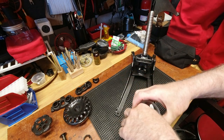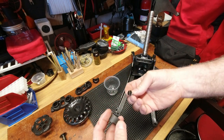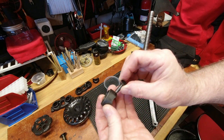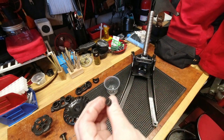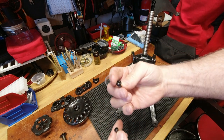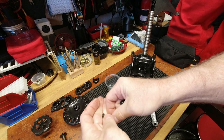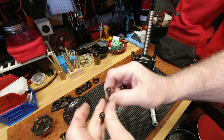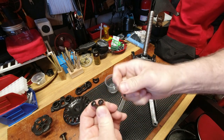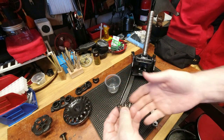In terms of the screws, all of the screws were reworked, re-blued, refinished. I have a really old video from a couple years ago. In fact, let's see, yeah, that might be where it actually hits on that giant piece of wood that I just showed you. But all of the screws, this one was the most mangled, and they came out pretty good. I hammered down the tops to even out all of the previous years of wrong screwdriver use and abuse, and then chucked them into the drill and over five different sandpapers to refinish the top, and then blued them.